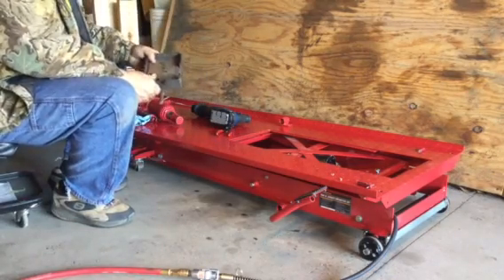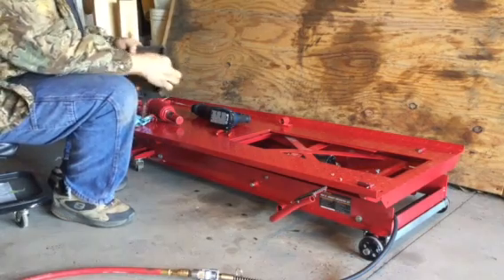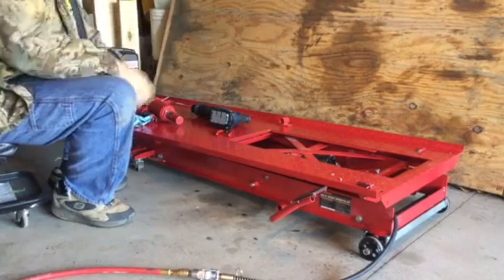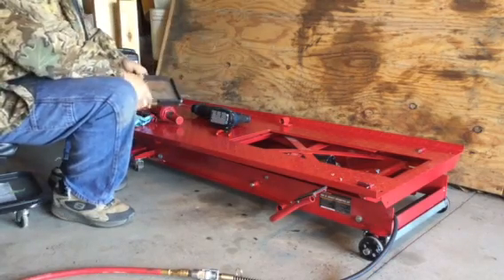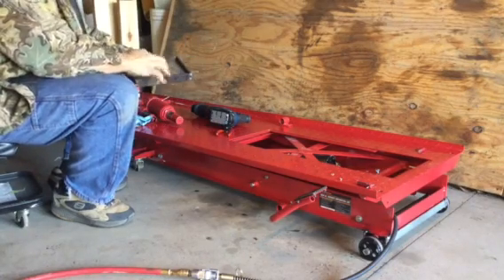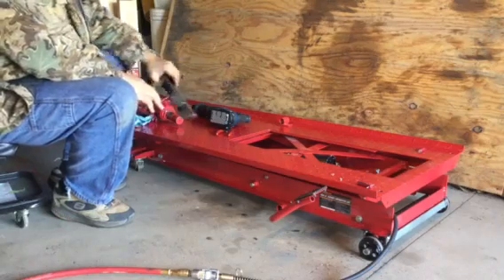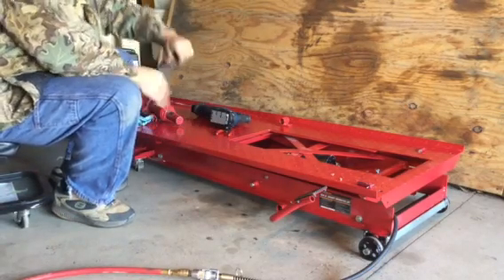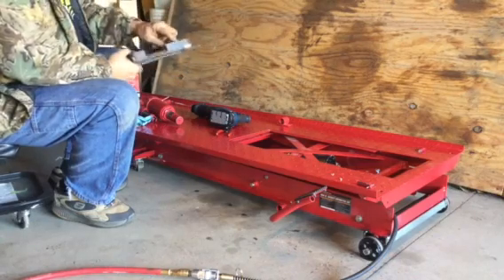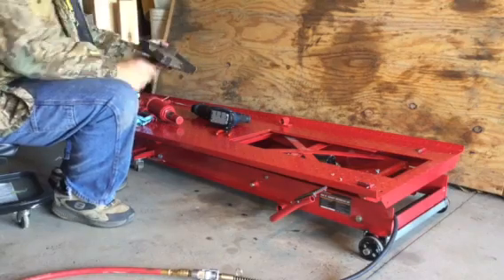This is the first model that I had, and I realized that the base plate was too thick and it was not giving me the tolerance I needed to fit the new bottle jack in there. So I made a new one minus the half-inch thick plate — I just used some eighth-inch sheet metal and some one-by-quarter-inch steel stock that I made a little frame around it.